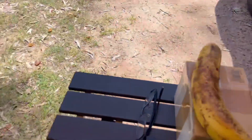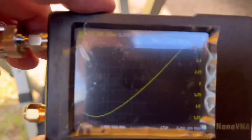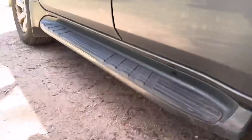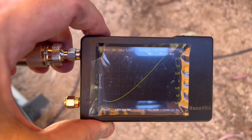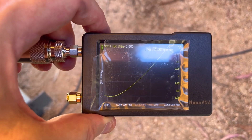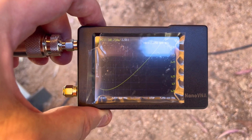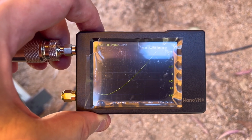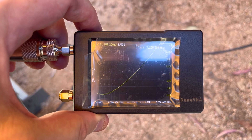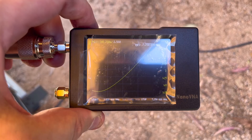On the nanoVNA you'll find a very sharp curve. I've got a little bit of a choke — just the excess coax. Without adjusting the telescopic whip, if I go another coil tap, it sits at about 7.165 MHz, which is where amateur radio is a secondary service. So to keep it lower in the band and keep the whip fully extended, this is where I'm sitting for now.